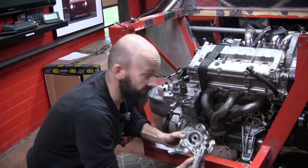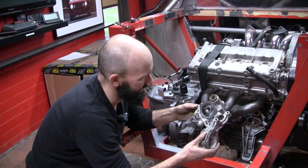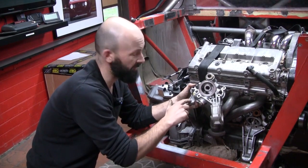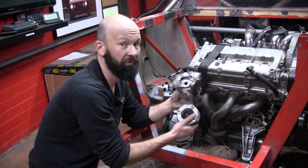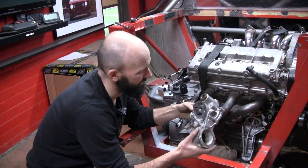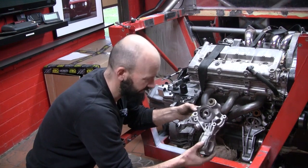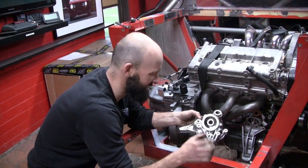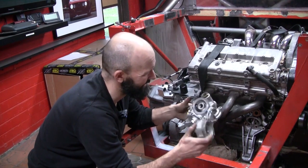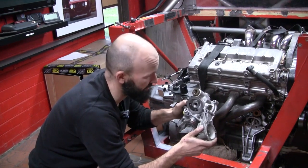The next option was to use this casting — it's got the bearing housing in exactly the right spot but no engine mount. I was thinking maybe we could make up a steel fabricated exoskeleton that picked up off those three points and the bearing bolts, then continued down to the engine mount. Definitely doable but a lot of work. I thought about welding a foot to this casting and beefing it up, but with all these sealing faces and welding an aluminium casting for a pretty high-stress component, I wasn't super happy with that.